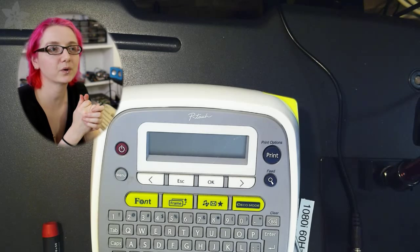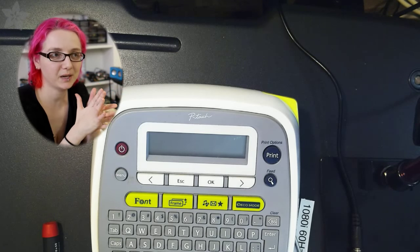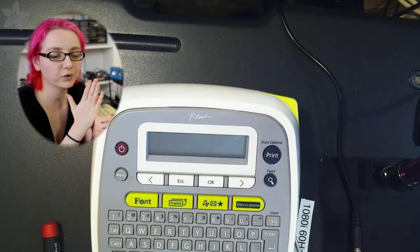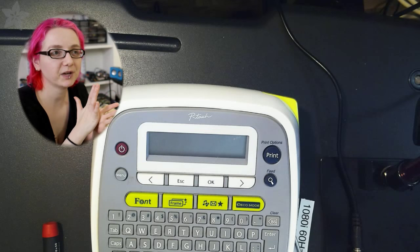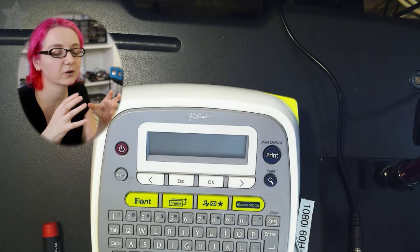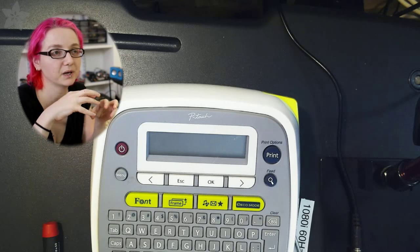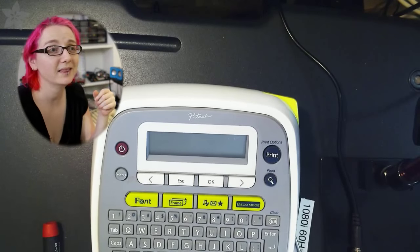I did repair something once with broken tantalum capacitors, and that was a pain because they dry out. If you have old equipment that you're turning on for the first time, you're going to get a lot of failures. Even if it wasn't broken, it'll start up and break because the tantalum capacitors are dried out and they'll fail instantly. But basically, look for electrolytics, look for swollen tops, swollen capacitors. That's a pretty good sign.